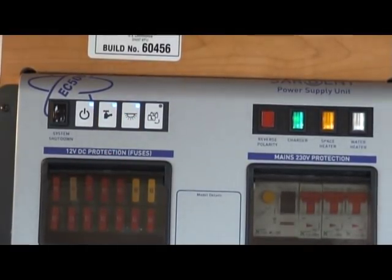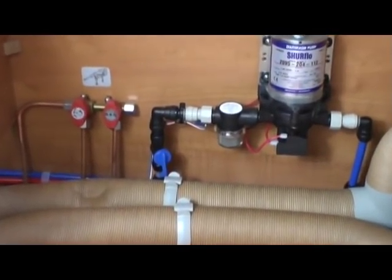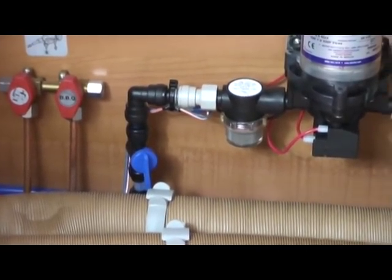So as the belt and braces approach at the end of the procedure, once again turn on the pump and open up the tap for a few seconds just to make sure that no water is trapped in there. Also, as a first time use, you should unscrew or disconnect the filter bottle just to make sure that there's no water trapped in there also. These can be very prone to breaking in a winter frost.